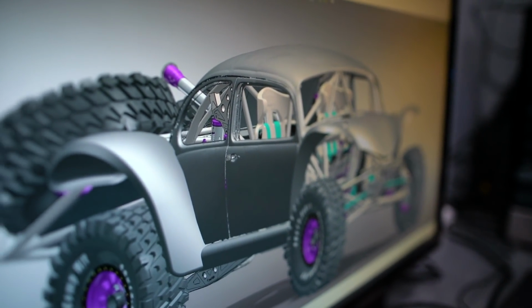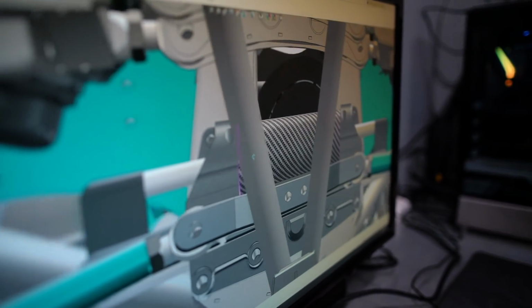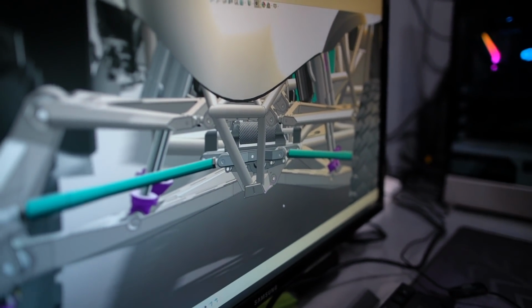We're also running a Howe 2 3/4 rack. That rack's a pretty penny, the TT rack. It's a hydraulic ram assist. Some guys use steering boxes. This is kind of a little bit of a simpler steering setup. You get a little bit more feedback through the wheel, but all in all, it's still super strong, and it's a simpler setup with fewer moving parts. Still proven, still works.